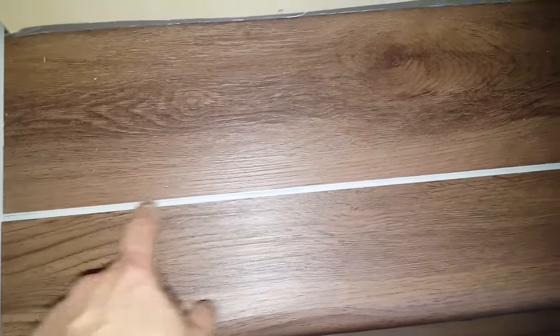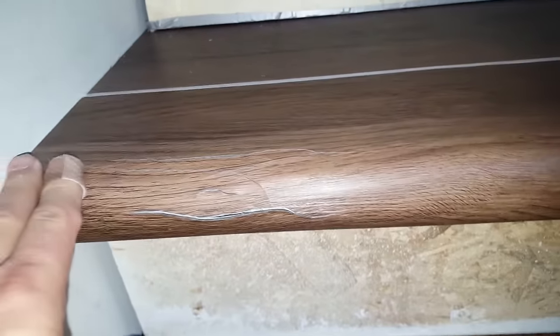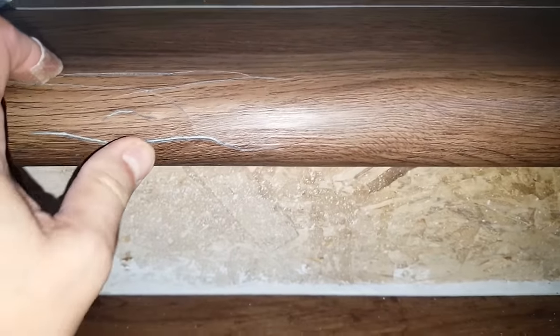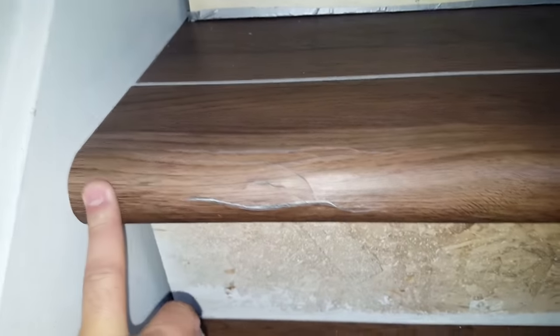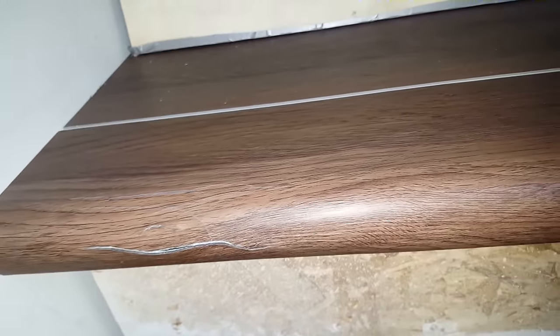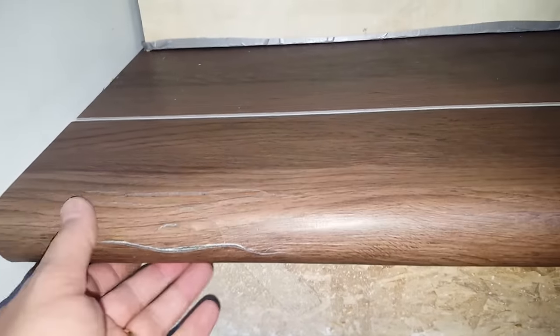And throughout my entire flooring process, I've always been making sure that this is nice and clean and there's no debris in there. For some reason, this time I didn't check it. There was a little chunk in there, so I got to where I was hammering. I was banging it in here, trying to get it lined up, because I thought for sure it was just something that needed to be bumped in there a little bit more. And I ended up banging it too hard. And there you see what happens, because as it got soft for the bending process, it also got a little brittle there. And my impatience cost me a board and a stair. And at that time, probably about 20 minutes of work, because I still wasn't quite sure what I was doing.